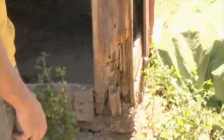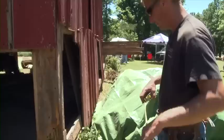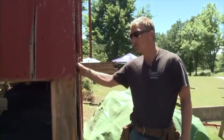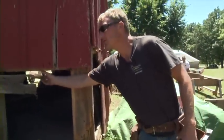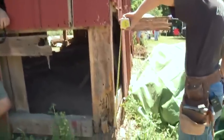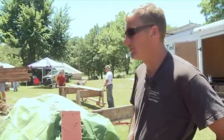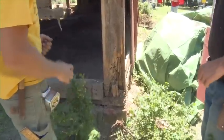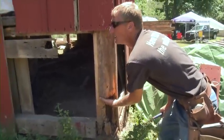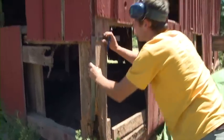We wanted to stay below that joinery, so we were able to cut away about 90% of the termite damage. If we get a jack and a 4x4 we can support it here and here. We'll scarf in about a 30-inch piece and lift off of it, since the rot is really confined to this area — it's probably solid right here.